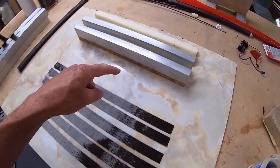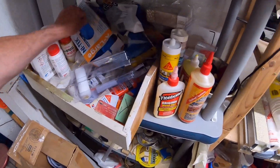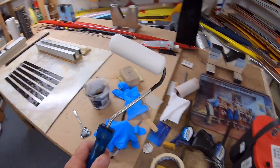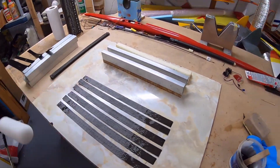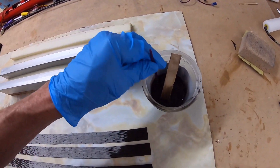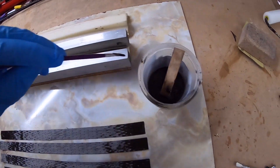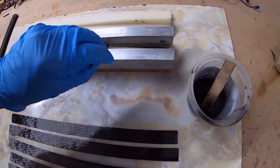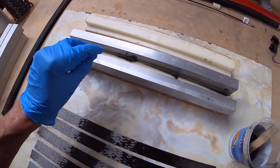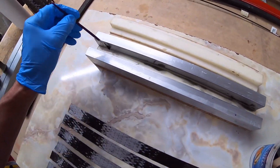Six of these on the top — which is that surface. This is a messy stage, so get yourself some surgical gloves. You'll need a roller; it makes life a lot easier. Wax the surface as well so you can reuse it. Brush resin into the corners to start — this resin flows, it's not as viscous as it could be, so it pays to get into the corners and slightly up the sides, on the top and bottom surfaces as well.